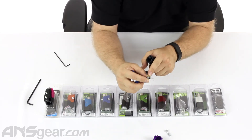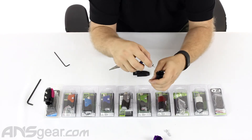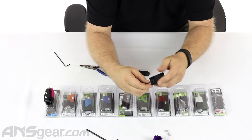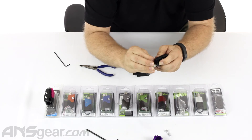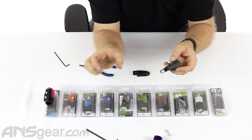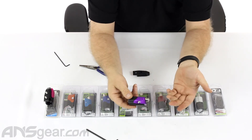It's a very simple core design: one O-ring on the middle, one O-ring at the bottom, and that takes care of everything. There are no internal hidden O-rings. If you get a leak, you can replace those O-rings. Just drop the core back in after you put a little grease on it, tighten it down, take your pin, put it through, put your O-ring back on the other side so the pin doesn't fall out. The pin has little recess grooves so the O-ring will sit in those grooves and center the post. Then put your cap on, line up your release pin, and lock it together.